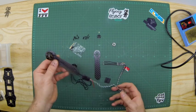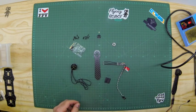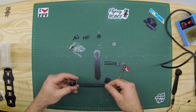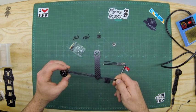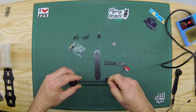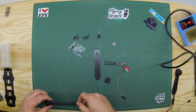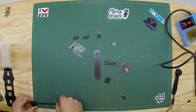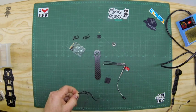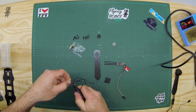We're going to start from there. We've got the motor here with these long wires coming out, which we need to shorten to the correct length. I've got a measuring guide here — I need to go to 11 centimeters — so just mark it with my finger, take the wire cutters, and cut.